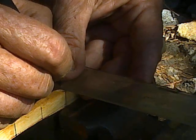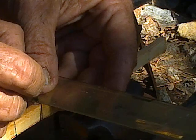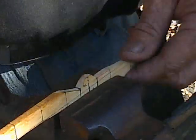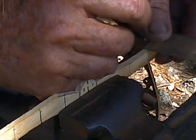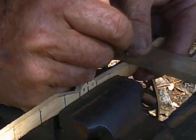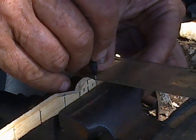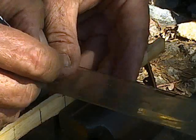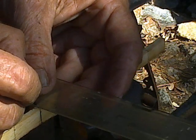And if somebody's setting themselves up as a bespoke propeller carver serving the light general aviation and ultralight market — and there are people who do that — every time they make a propeller they've never made before, they don't charge the customer for the design work and carving the first one. They stick the first one onto their copying machine, and the one they sell the customer is the copy. The one they keep is the one waiting there for next time the customer wants the same propeller, and they have racks of them.